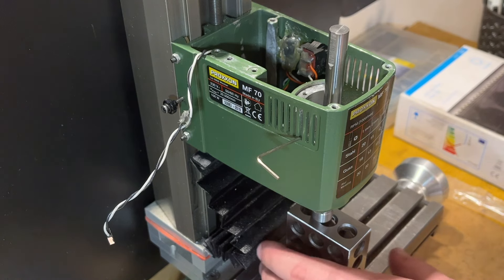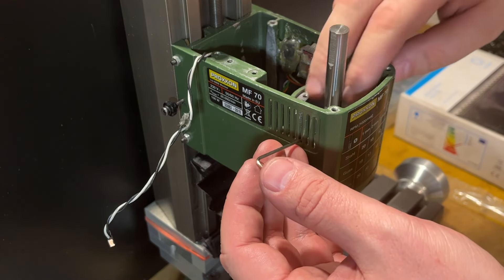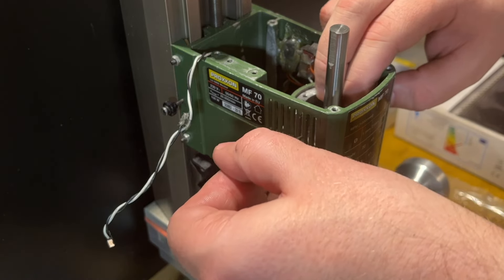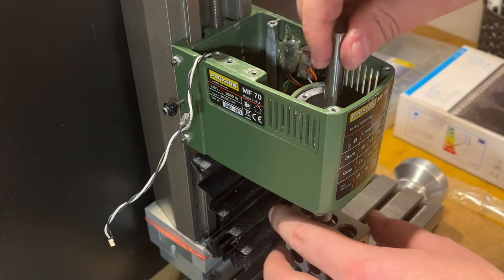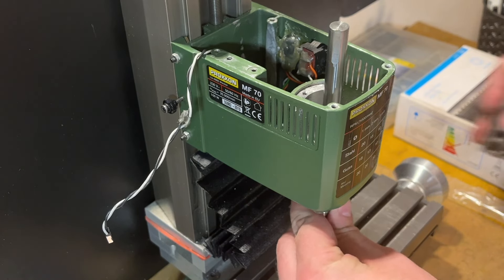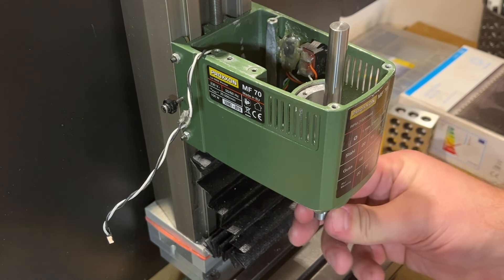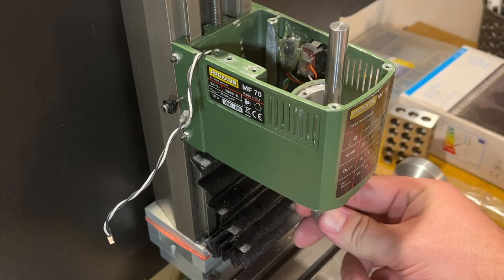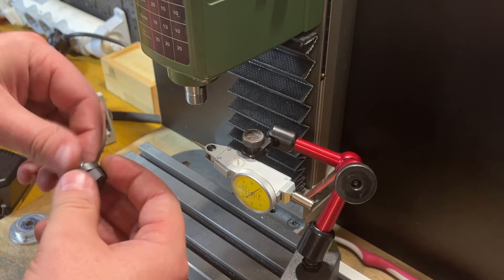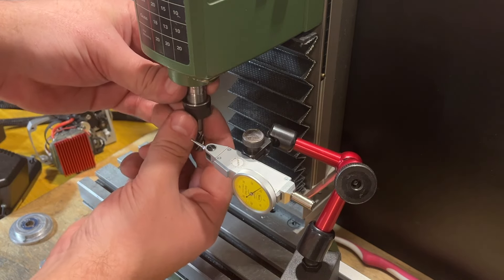The installation — I'm doing everything pressing down the spindle with a 1-2-3 block, and then pressing with my fingers this fixing nut and screwing down the screw. Now it should be okay — should be without major play and accurate enough. Now let's check the runout. So: the new nut and new collet, my old end mill on a new spindle.